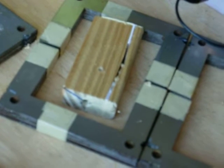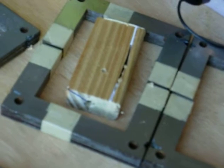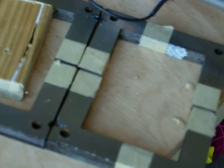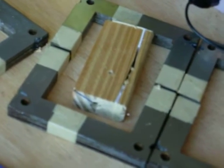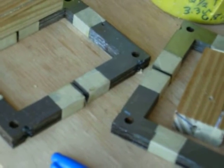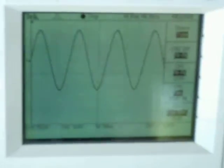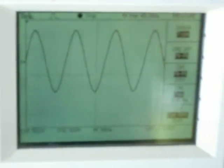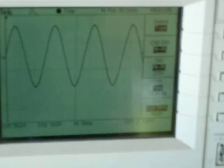I'm getting closer. I love the way this motor runs — it's smooth, no vibration in the board at all. The heat shrink tubing with the goop squirted in the middle, and a plastic fitting from the hardware store on the other side — that's working great. At 12 volts I'm getting 220 out. I'm not sure what it'll do at 24 volts yet — I need to do that test. The sine wave is looking good: a nice clean sine wave, no spikes or squares. But that's with no load on it.